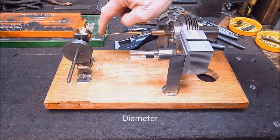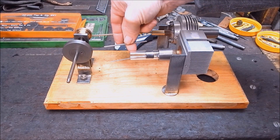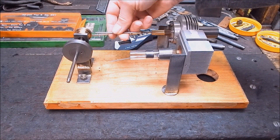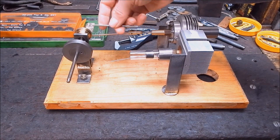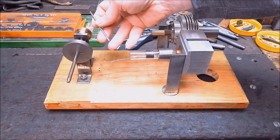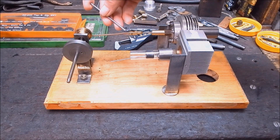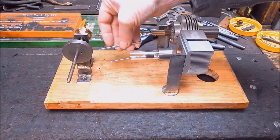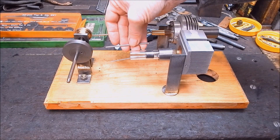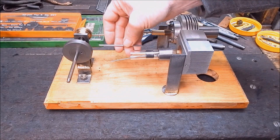Now, the con rod — which is this stuff — is Chinese shish kebab skewer from the old Chinese bits and pieces shop. I think I got 12 of them for $3. They're very uniform and they're good stainless steel. Now I'll have to braze a head on the end of it, but the other end, where it goes onto here, I'm going to have to drill out the rod. So I'm going to have to drill out this 3.02mm stainless steel rod with a 1.475mm drill. 1.475mm, guys — that's pretty small. Stainless steel we're going into, remember.